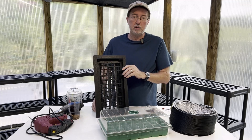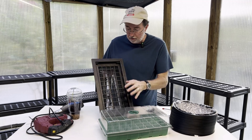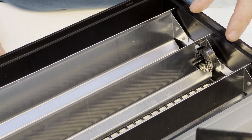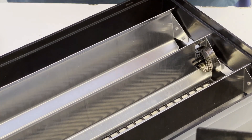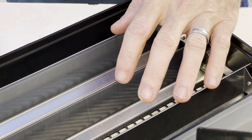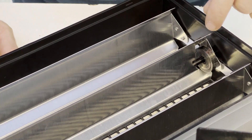The one device that makes all of this work is this right here — an automatic foundation vent. It's completely works off of air temperature, not electricity, no mechanical things like that. It's completely self-sufficient. It doesn't need anything to work except for changes in air temperature. Now the way this automatic foundation vent works is really genius. It's from the 20th century — not a 21st century invention. There's a little coil in there. These louvers are controlled by that coil, and you can test it in your own freezer. This coil, as it reaches 40 degrees, will start to contract and close these louvers. As it hits 70 degrees inside of your container system, this coil will start to unravel itself and open the vent, allowing the hot air to escape. It's just really amazing technology based on science. That's what makes this whole thing possible.